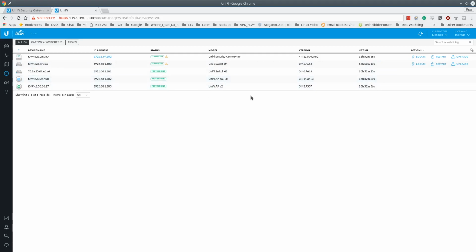Now, when I do the firmware upgrades, I'm going to start with the connected devices, then do the switches last. You just got to think about the order you're doing. You don't want to push all the firmware at the same time because it's smart and it should stop it from doing something stupid. But just in case anything's overlooked, why chance running into an error with that? So now I'm going to run through the upgrades. We're going to start with the peripheral devices. I'm going to update this. And then this particular APC ALR needs an upgrade. And then lastly, I'll do the switches.